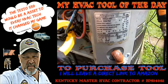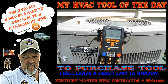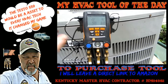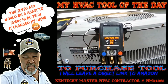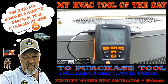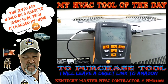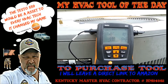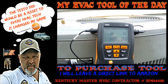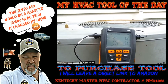Alright guys, we're low on refrigerant, go ahead and add a little bit of refrigerant and we're going to get this thing to 13 degrees superheat and get this puppy up and going. I was looking for 13 degrees superheat - she's kind of fluctuating between 12 and 14 or so, but I'm allowed plus or minus 5 on my superheat. It's a fixed orifice system so I think I've got her dialed in pretty good. Let me get buttoned up here.